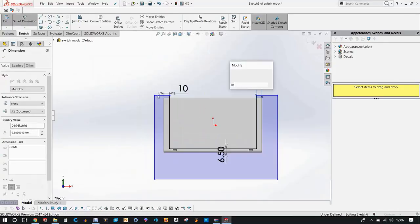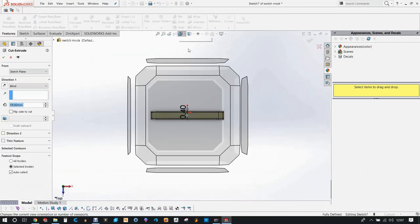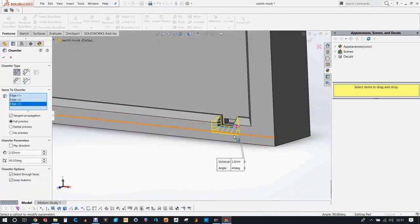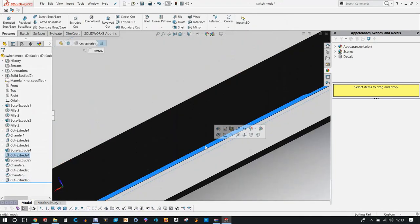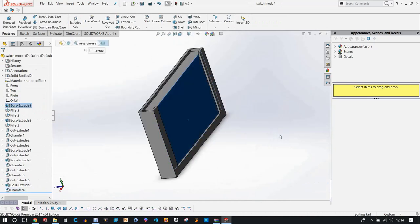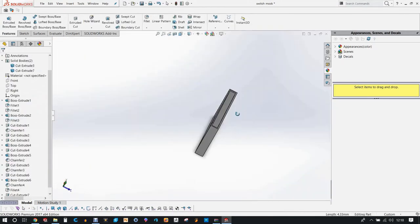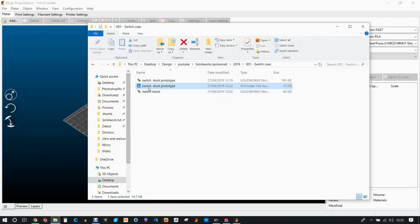From there, I needed to test that my measurements were correct. So around that body, I built a little prototype box. This is the first stage. This is to ensure that the dummy Switch that I made in Solidworks is the same dimensions as the actual Switch screen. So by doing a quick little prototype and printing it out, it's much quicker than just getting carried away with the whole design process and realizing it's wrong, having to go back.